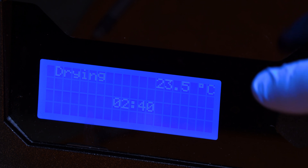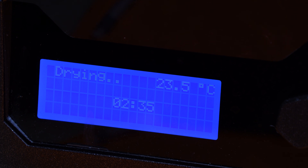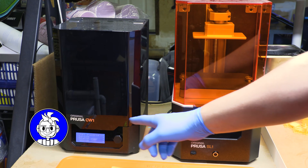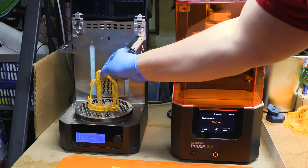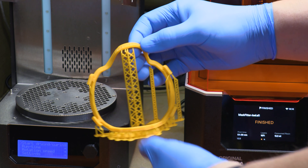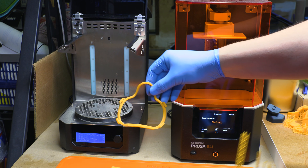You can actually cause that temperature to go up. You can preheat, which is nice if you have this in a cold location and you need to preheat your resin. Right now it will heat as it's drying. It's going to go for three minutes. There are UV lights in there — if I lift this up, the UV lights stop. It's all cured. Let's take a look. It's a little bit warm in there, which is great. And here it is — look at that, that's cured. Supports for something like this just come off just like that. Wow — that's fantastic. Those came off super easy.